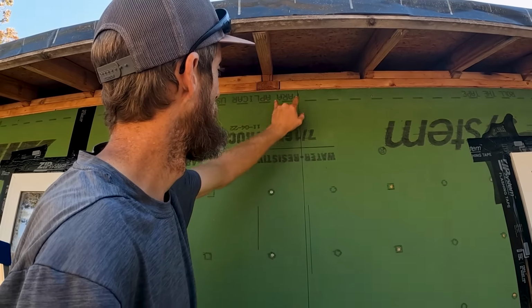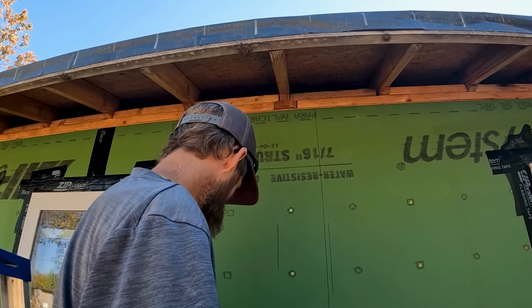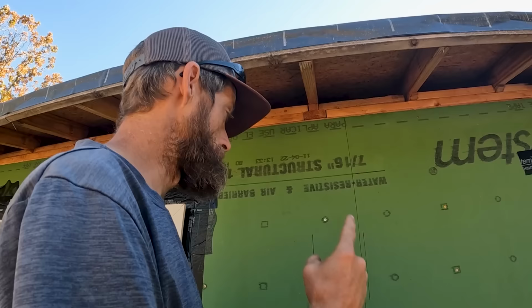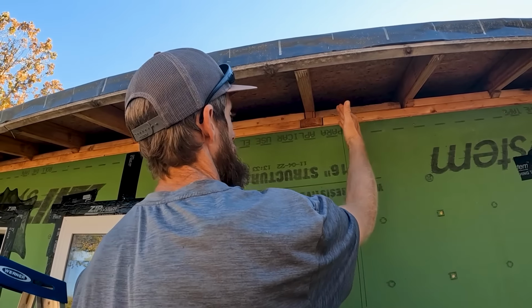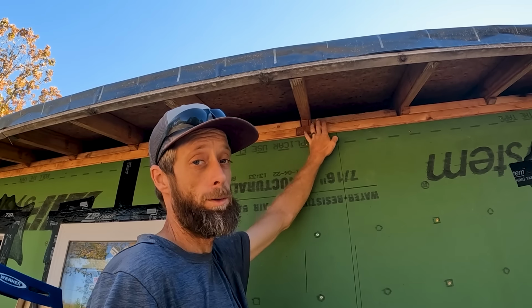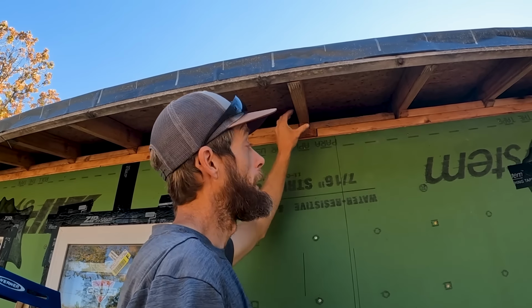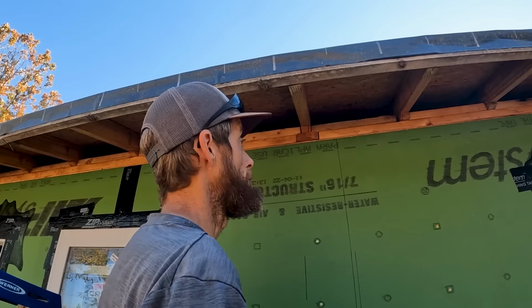All right. We're about 5.5 inches, this guy's gonna have to end up going, regardless. But how far do I need to go that way? In all reality, I have no idea. However, I do know I'm gonna put sheathing on this side. So I'm just gonna go straight back, flush with the inner wall, not the outer sheathing, because we still need to trim this a little bit. And this is a huge part why we didn't put pieces up here just yet.